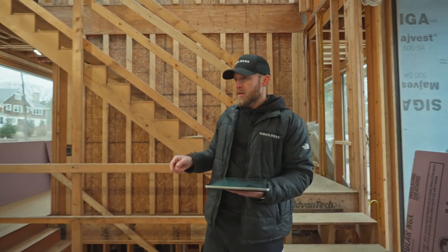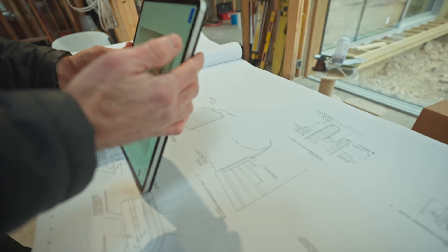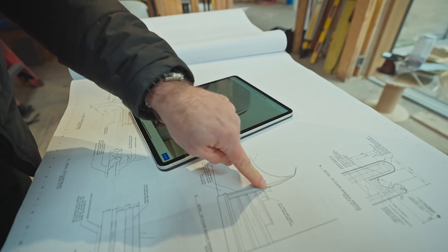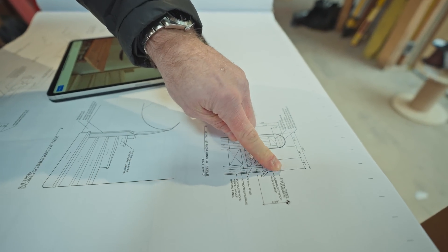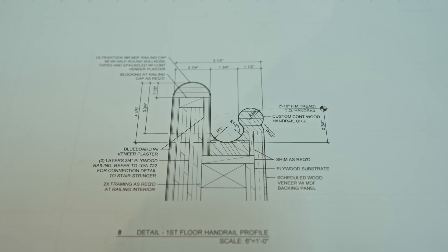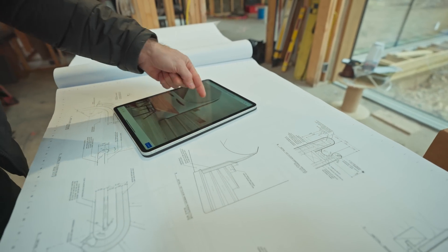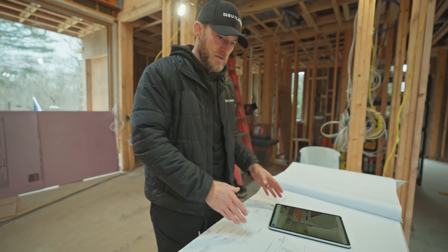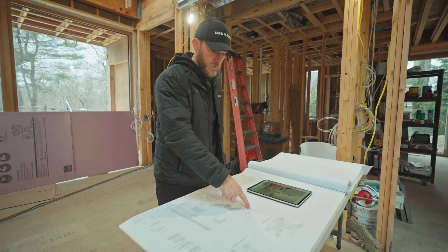On the drawings you can actually see the plaster wall I was showing you. Looking at the rendering, you have the plaster section and then right on the other side is this white oak handrail — and here is the profile. You have your plaster, then a radius, and then it's all white oak all the way down to the stair treads and risers. You can see how complicated that is as a straight section, never mind coming down with this really nice curve that rolls all the way down to that first tread. This is going to take a lot of really specialized carpentry and time, and our crew is going to have to work very carefully between the trades — between plaster and millwork.